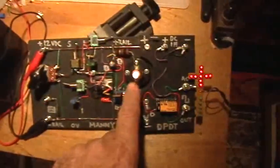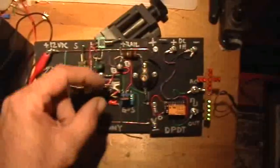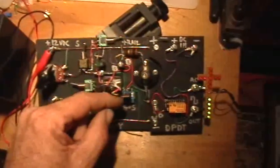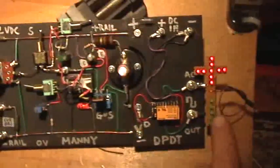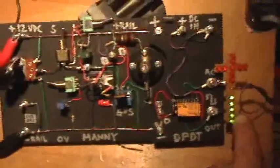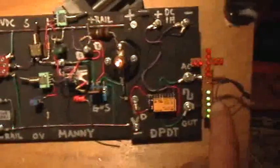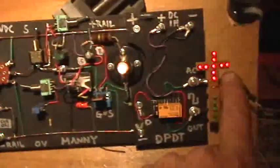As you can see, we're going up from plus to minus, plus to minus, based on the time delay of the voltage fluctuating up and down around 4 volts — the reservoir charge on that capacitor is fluctuating up and down 4 volts and controlling the MOSFET gate. I've got ordinary positive red LEDs here that respond to a positive current flow, and some special negative green LEDs here that only respond to a reverse negative current flow. Anyone can see that that's exactly what's going on — we have positive current and negative current, based on DC inputs. These are just hooked directly to the DC battery.